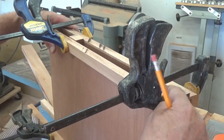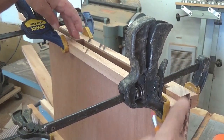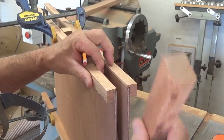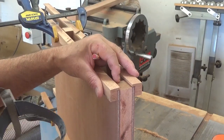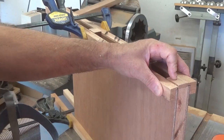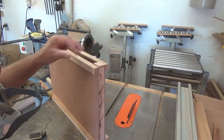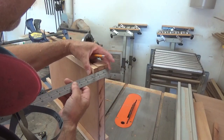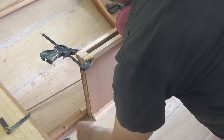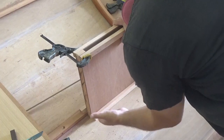I'm going to recess in and cut this a bit short and put a piece in here just so I'm not looking at end grain. This end grain won't be seen — it'll be under the seat and this will get cut short. The end cap piece is not wide enough; I'll have to go rip another piece to be two and a half inches. For the box to sit vertical, we put that slope in the bottom of the boat here plus the fillets, so by my calculation that's the angle the bottom needs to be beveled.